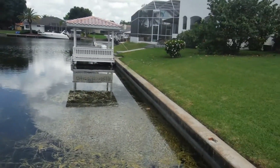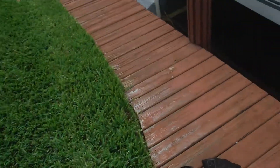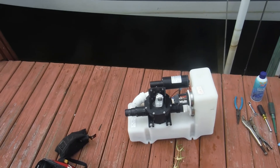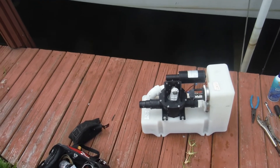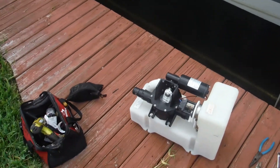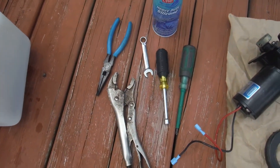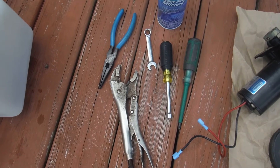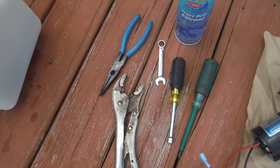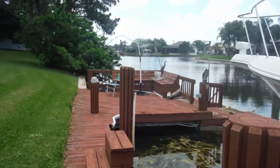I wanted to show you all a VG motor and bellows replacement kit. It took me about 30 minutes to rebuild. Now I've got to crawl back in that hole, get her reconnected to the inlet and outlet hoses and 12-volt DC, then do a startup check — vacuum rinse some water through it — and we'll be good to go. One lesson: only use hand tools. Don't use a drill. Only hand tools. And wear gloves.